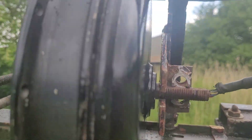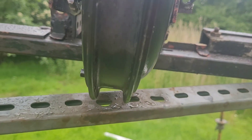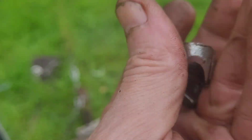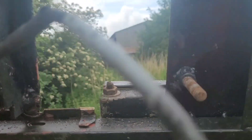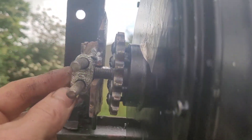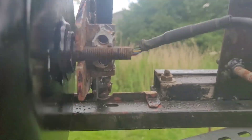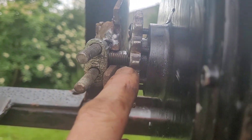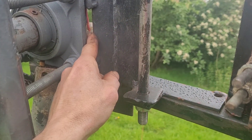That's how it sits in, and I just wanted to show you it'll happily sit there with no bolts in, because the turbine's on its side. Obviously put the turbine up on the tower — that's why you need these on that side: one of those and then two M8 nuts, and then on this side two bolts will go all the way through. I have to wait for my son to come around to put the blades on, which will be a day or two. There's room to move that backwards — it can go back another five mil — and that means we should be clear with the chain gear, which is the 18 tooth one. One main difference is that on the other turbine the wires came out the same side, but on this one they come out the other side, which just means they need to be routed round and connected to the bit at the top of the tower.